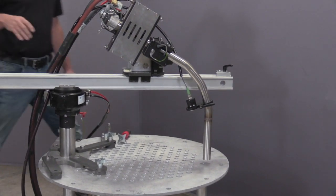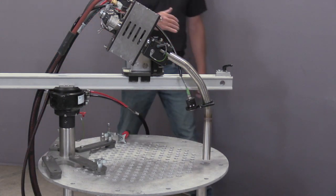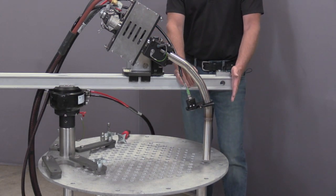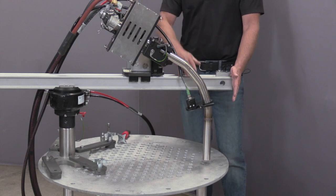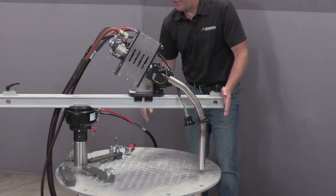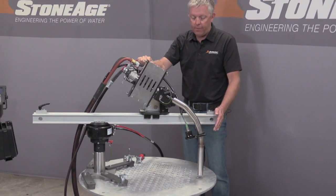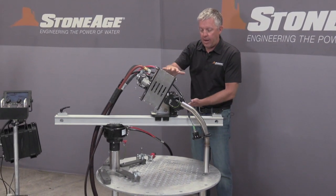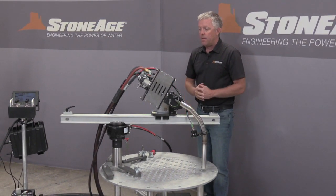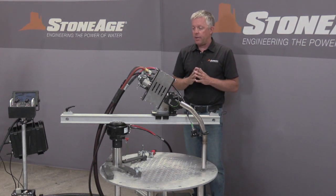By having a single pivot point where our spider plate is, that allows us to rotate across an arc. And that allows us to get right up against the edge of a dome. And typically, the dome height is very short on these. In fact, a guy who would be sitting on a bucket on top of the heat exchanger face would be crouched over with his head up against the inside ceiling of the work environment. So this reduces our height and gets a reach out that allows us to get all those tubes once again. So those are very, very important industry unique items there.